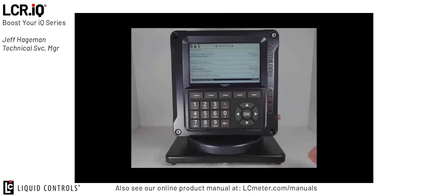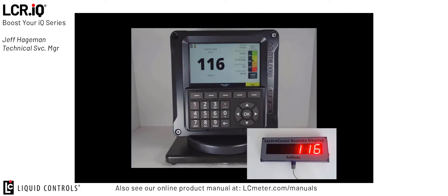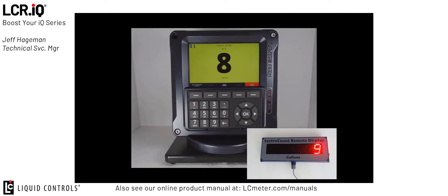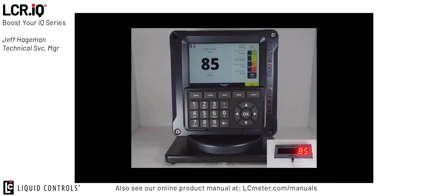To demonstrate this feature, I'm going to place the register back in the normal run position by threading the bolt back into the housing until it's tight against the front cover. Then I'll press the home button to return to my main delivery screen. Let's add a second camera focused on our XL display so we can compare the main display of the IQ register to the XL display. To begin a delivery, I'll press the start button, which will perform the counter test. Now the register is delivering and you can see the XL display is also counting. If I press stop or pause, you'll see these numbers are reading the exact same information. I can press resume and they'll continue to count. Pressing end will end the transaction, and that's the information that should be on both displays.